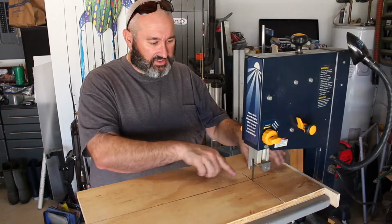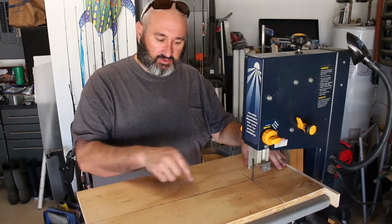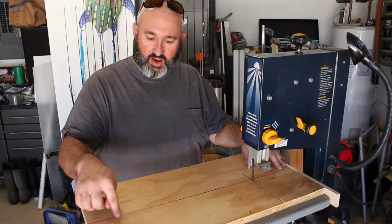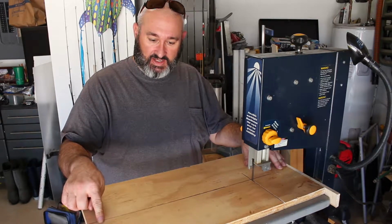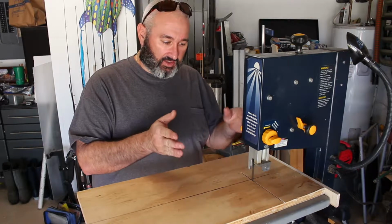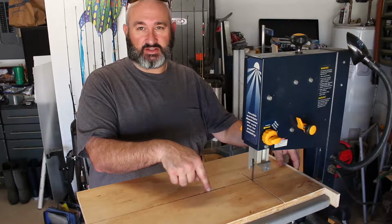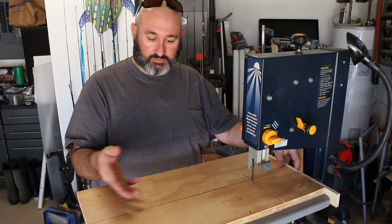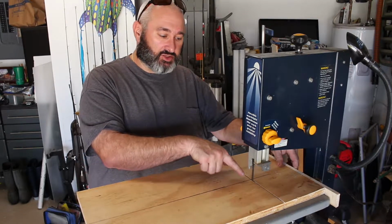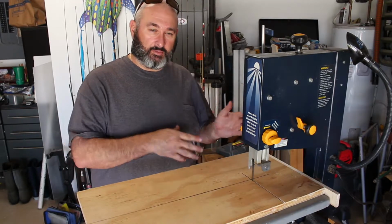Alright, now I'm going to take a really nice measurement from right here, mark out on here, and pre-drill little tiny holes just so I have pin references for where these diameters are going to be. Now, when you're doing diameter, don't forget, you only want half. So if I come out here at 6, it's going to be a 12-inch circle. If I come out here at 10, it's going to be a 20, etc. So go ahead and mark it off, but make sure your reference number on here actually states the true diameter of what you're going to be making.